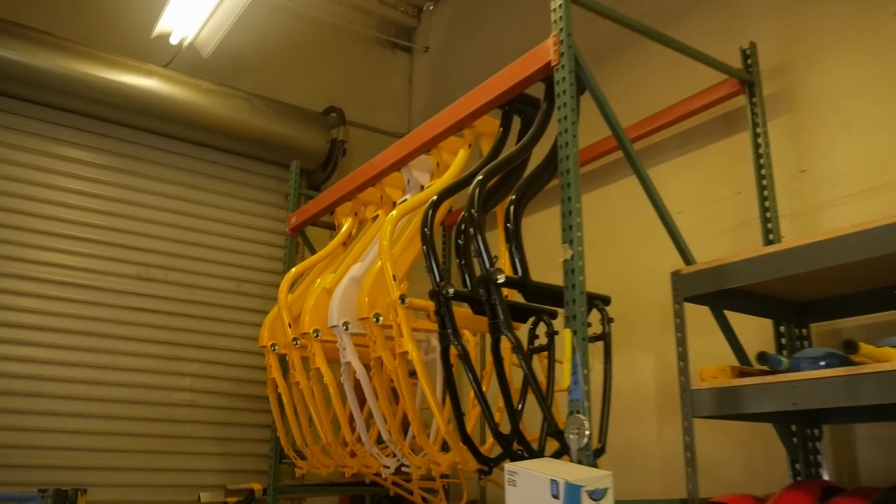Once it's there, we want to keep the production going. With one color, it's still in the air a little bit, and it's in the filters, so we have to get that color out, change the filters, make sure the air quality is good, and then start the next color. But you don't want to start too soon. If you take it out of the booth, you get all the dust settling on it. So there's this timing thing. It's how much hardener you have on there. You have to make sure it dries, but not too quickly, or it's going to flake. You put enough hardener and keep it in there enough time. The guys reset and re-prep, and make sure the next color gets painted. It's just enough time to bring it out and hang it properly without getting contaminated.